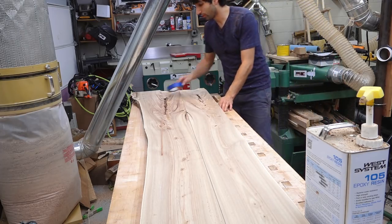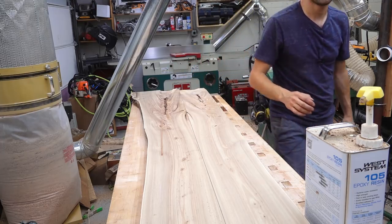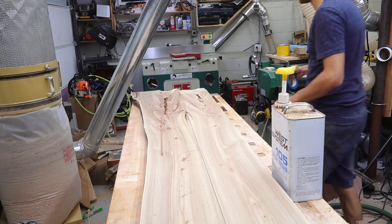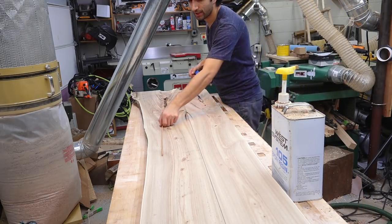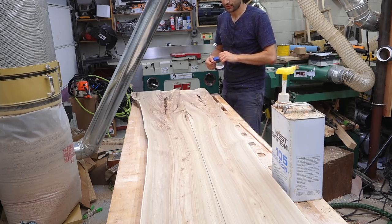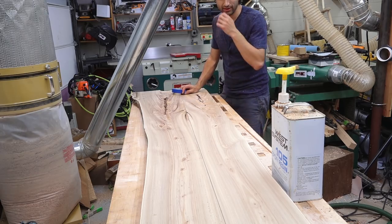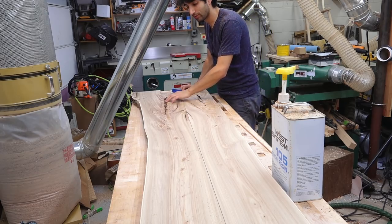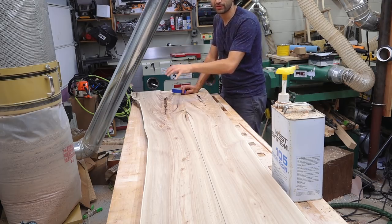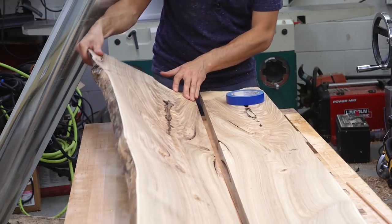To move forward, I'm going to start with some epoxy filling. The first pour will be a clear epoxy. That's going to do two things: first, it's going to go all the way down to the bottom and seal up the underside since these voids run all the way through. The other thing is that because we're going to come back and fill with a tinted epoxy, the clear epoxy will soak into the bark in the middle and solidify it so it won't absorb any of the tint from the secondary epoxy. That should help keep things looking pretty even.